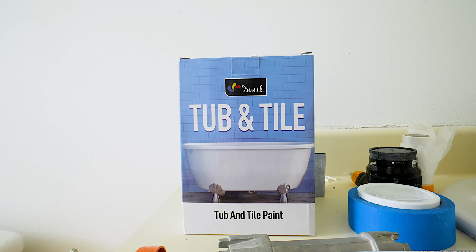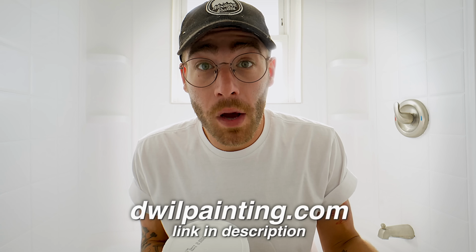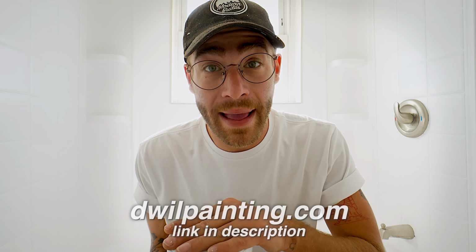My final thoughts are that I would totally recommend the Dwill tub and tile paint kit if you're working on a tub or shower like this. If the surface you're painting has a lot of flat walls rather than contours, I think you could get by with 2 coats using white paint. Overall, I did 3 with the roller and then 1 extra touch-up coat with just the brush in the corners. And I used exactly 1 tub of this paint. And this says 33 ounces.